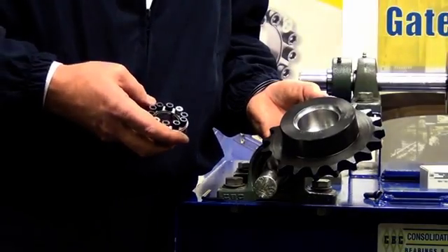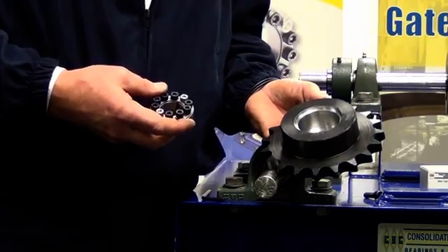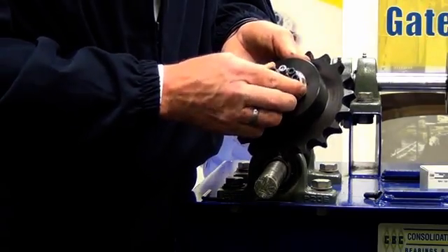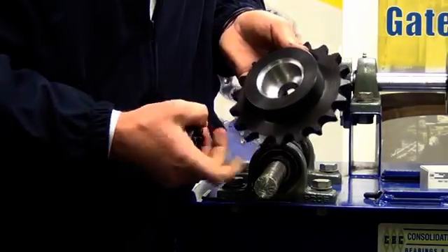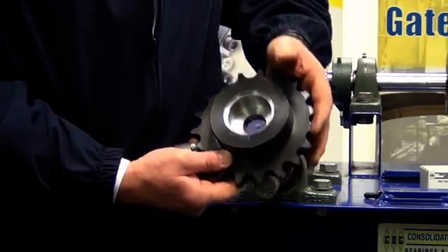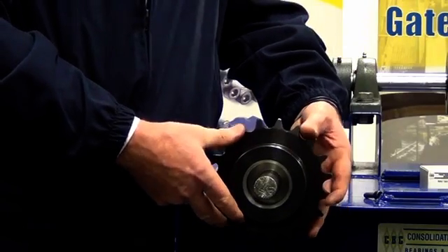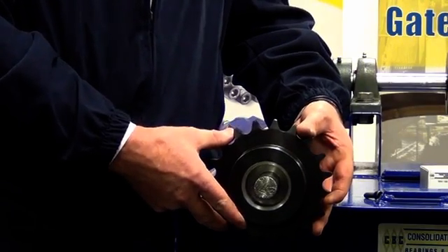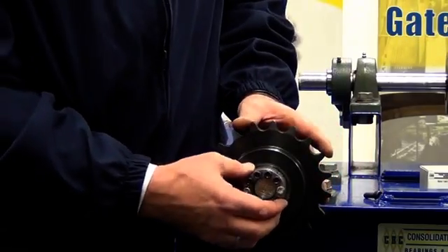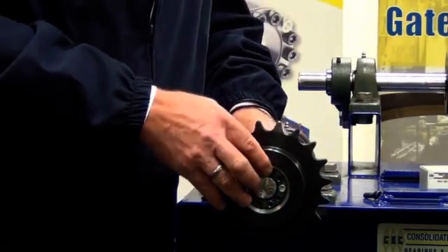Now looking at the 2005 series, which is the classic Mavlock, we're going to do the same installation with a slightly different method. You'll notice that the sprocket here is machined to suit the outside diameter of the unit. You'll also notice that the back of the unit has a machined clearance hole or step. That's to ensure, for this series only, that the unit is central on the shaft — it's actually acting as a centering tool. Now that it's on there with all the screws loosened, it's in its relaxed position and goes on there nice and easily, still relatively loose.